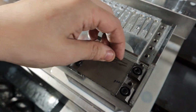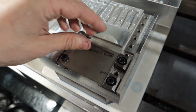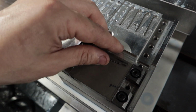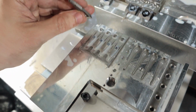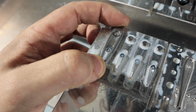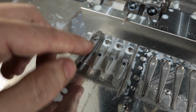Then what happens is I'm not cutting them out of the stock. I'm leaving them in the stock. The pocket is cut on the first op, but the outside profile is left. And so you can imagine there's 4 of them in this little piece. Then you flip the stock over, and they get forced up against this dowel pin and these little inserts that I made. So you've got 4 of them sitting here, located against the dowel pin and inserts. And then I have a screw that holds the center of the body down.